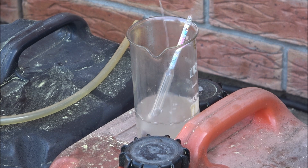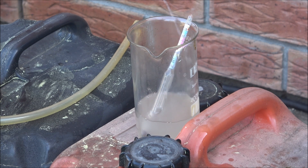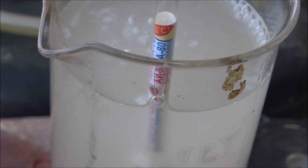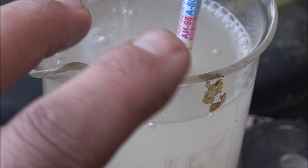The petrol coming out is a little bit cloudy, possibly due to some water content. Water has a boiling point of just 100°C, and petrol starts to boil at 42°C up to 200°C including all fractions, so it definitely picks up some water with it. If you let it settle for a day or two it becomes absolutely transparent. It's sitting on the bottom, not floating, which indicates we're definitely getting petrol coming out.